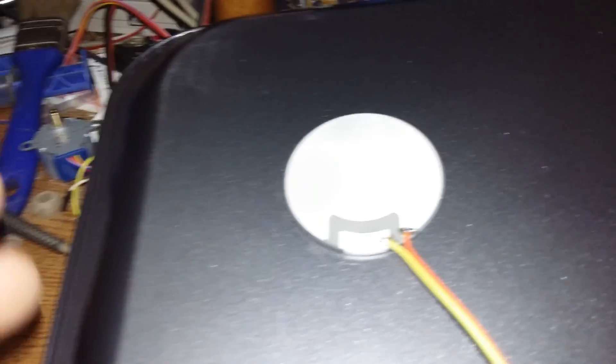I wish I could show you how it works. It will be good for cleaning everything. I have planned to buy another one to put here, and this will serve for cleaning dirty parts — for example, when you disassemble some mechanical part, you put in detergent and water. Somebody recommends gasoline, but I'm not sure. So ordinary water, detergent, even laundry detergent. The point is it vibrates 40,000 times per second — like using a brush and quickly brushing. The detergent goes into every pore, every hole, inside whatever you put in.